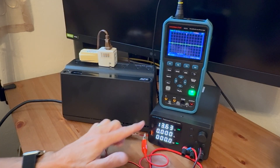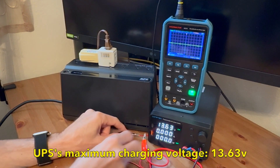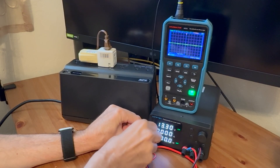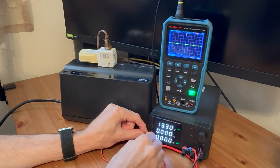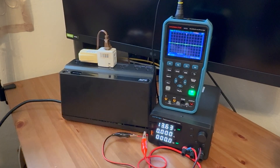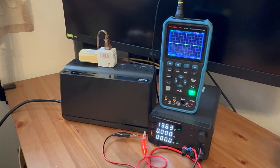So if there was a battery here, the maximum voltage it could charge to would be 13.63 volts. I'll confirm that because if I take this off, you'll see it jumps down to the configured voltage which is 13.3, which we can adjust. But when you hook this back up, it shows you the actual voltage on the input. That's what this power supply shows you — the actual voltage.